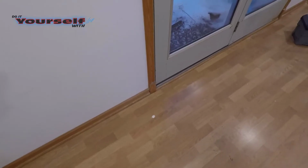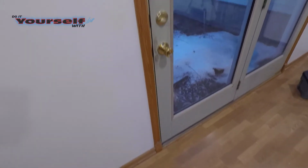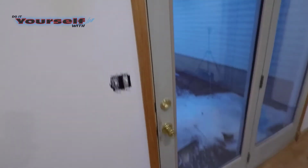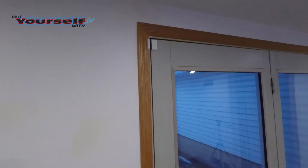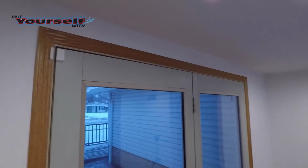What I did with the exterior doors and the trim was use white satin spray paint. The entrance door to this house had metal skins over a wood core. I don't like painting them with a brush and latex paint because then the brush marks show, and I like the doors to look new, so I used spray paint to achieve this.